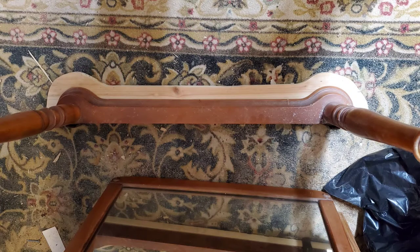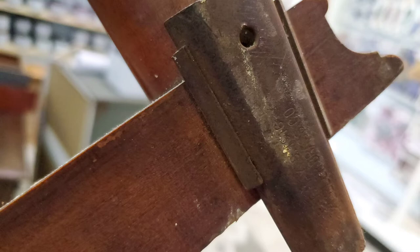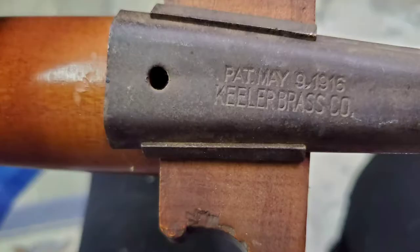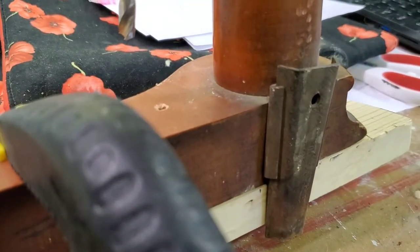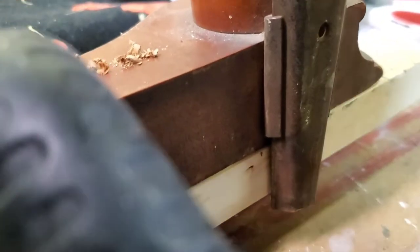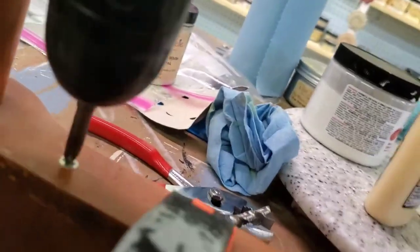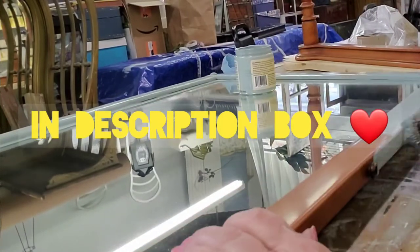So there it is just kind of held up against the other piece. I really struggled with these pieces on the back of the mirror — they're meant to attach it to the dresser. I tried to remove them but couldn't figure it out, and they're not going anywhere. Look how old this is — 1916! That really helps me place the date of the mirror. I take some wood glue, attach the pieces, and clamp them. Here I'm showing you how to do a recessed hole: I already had a hole drilled with a smaller bit, then I take a larger bit and just do a little bit at the top, and it really helps that screw be flush so it's not sticking out.